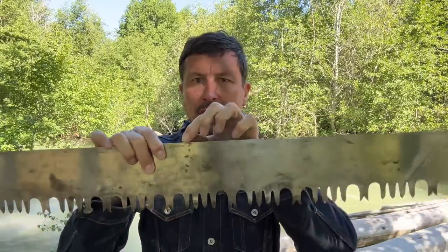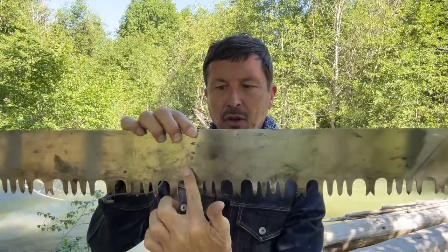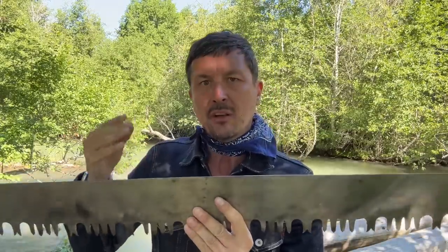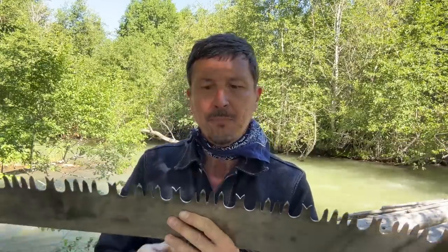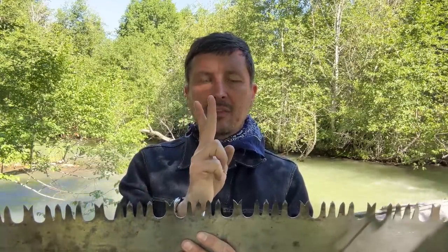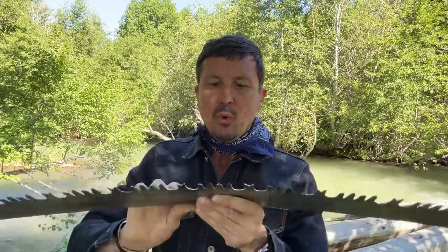The thinnest part of the saw is on the back, the spine right here at the waist, and it starts to taper thicker and thicker towards the handles, and also thicker and thicker towards the rakers and the teeth. The reason for that is the back is thin so it doesn't get caught in the kerf. The kerf — when you cut with a skill saw or chainsaw, the gap that is made is called the kerf — and the thinner this could be, the less wood you had to cut, therefore the less set you had to have in the teeth. Whenever you have a saw, the teeth need to alternate — it's called the set — and if the teeth are not set properly, the saw will bind in the kerf.